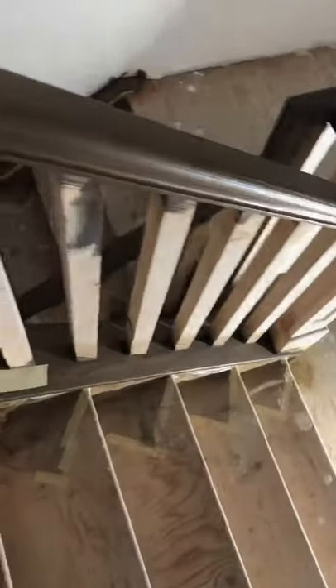Once your stain is done, dry, smooth, and completed, we start taping off the oak parts so we can spray primer on the banisters and posts. We use an automotive tape that won't curl underneath our solvent-based primers — it's an American PG brand tape. We use this to tight-mask around all the spindles so that when we spray the primer, the tape isn't going to curl, and when we unmask it, we get tight, crisp lines.